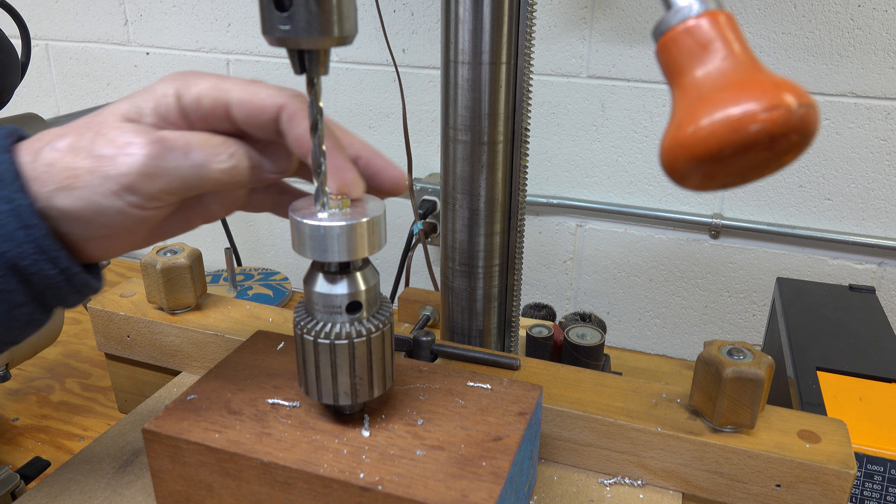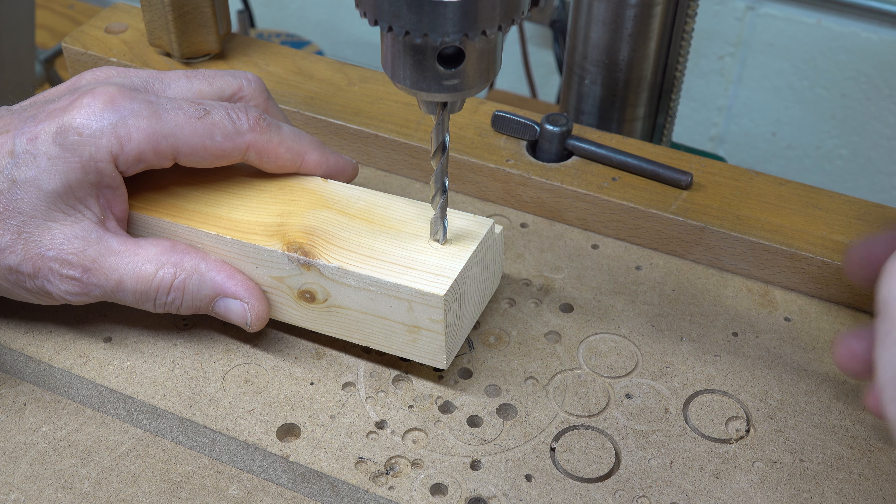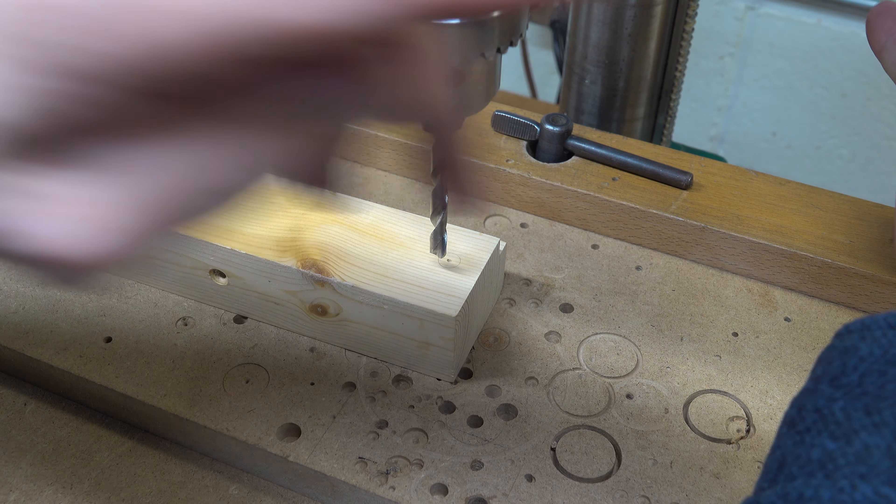For the next tip, what I like to do is put a small center punch so the tip of your drill can nest in the middle of it. Don't make it too big — if you have a small drill, that's kind of where I'm going here. Bring your part up to your drill bit and you can feel it nest where it can't go left, right, forward, or back. You can feel it sitting in there.